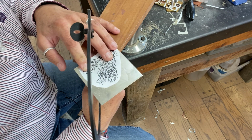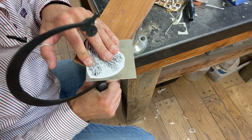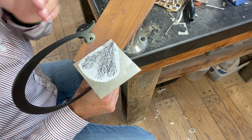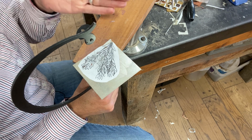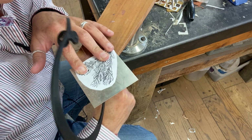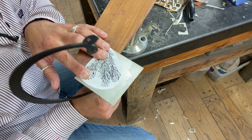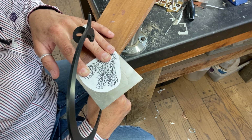If the area that I'm cutting into is like 45 degrees and less, I'll cut from one side and then pull my blade back out like I did right here. Cut in one side, pull my blade back out, and then cut over, and then I'll cut down to the V. If it's like this one that I'm coming up to right now, I want that V to be very definite. So I'll pull my blade back out, and then I'll kind of come over and cut into it because it'll give this more definition.